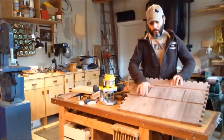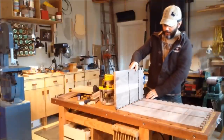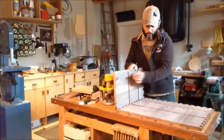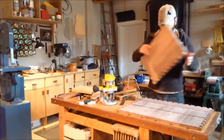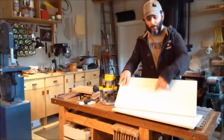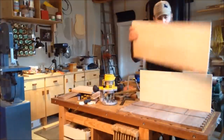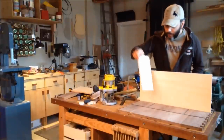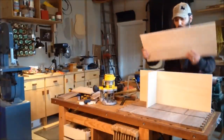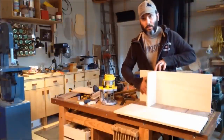I've done all the grooves inside the back section and also on the sides. I made sure after they were done that they were lining up — one of them was about a sixteenth off, so I just ran another pass on that one. I've got the two sides done. Now I need to mark where the grooves are going to be in the plywood as well, because the other piece is going to go in here and be sandwiched in between the two. So I'm going to grab my pencil and mark it.